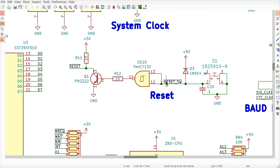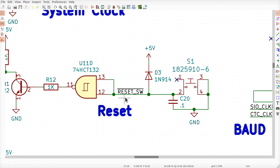Okay. Let's look and see what happens when the power shuts off. Well, when the power is turned off, most gates will be very upset. Basically, it'll destroy their circuit if there's a high voltage on this signal right here when there's no power applied to the NAND gate over here. Okay? Now, remember, once the reset is done, this capacitor will have charged up to 5 volts. If we take the power off of our system, this goes to zero almost immediately. And there is a resistor, remember, the 10K, that does pull this signal over to what would be 5 volts. It would now be pulling it towards ground, okay?